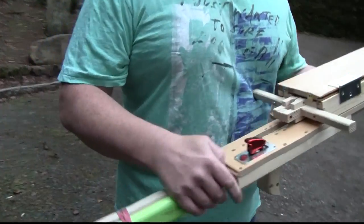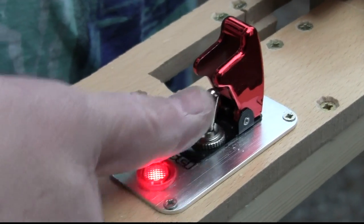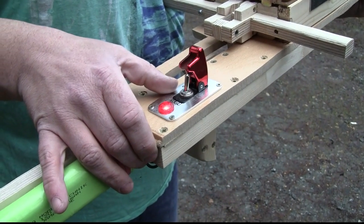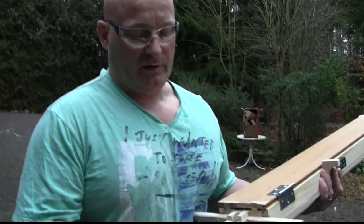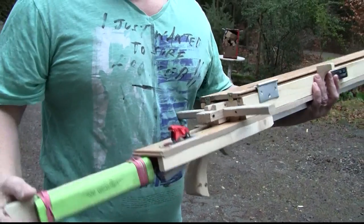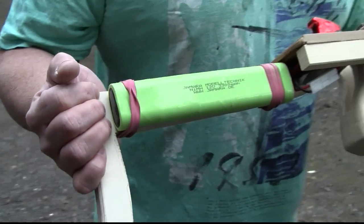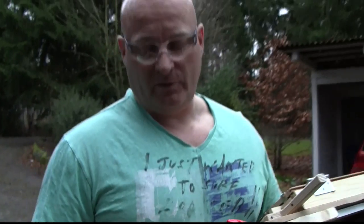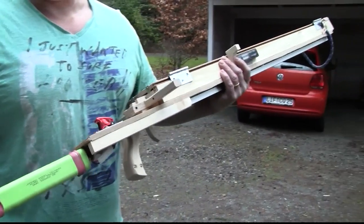There is a release, and the release has to block the way so the heat cannot escape. I can switch the heating on by opening this safety catch and switching on the power. Now it starts to heat up, and the temperature inside will increase — it goes all the way up to 40 degrees centigrade, about as hot as rubber can tolerate on a very hot summer day. It is equipped with a high-capacity accumulator pack — in this case 3.3 amperes, which means it can maintain this for about 20 minutes. Not very long, but it doesn't take long to heat up the little amount of air trapped in here.